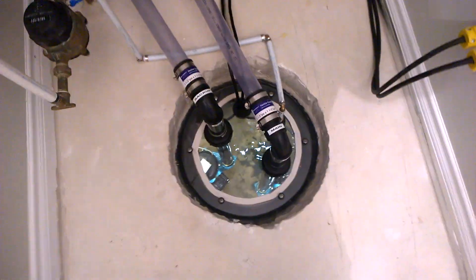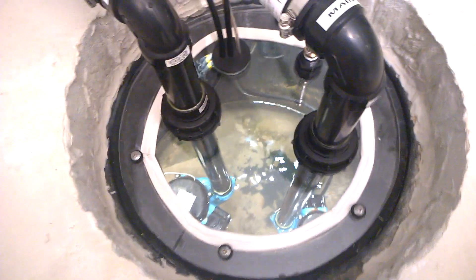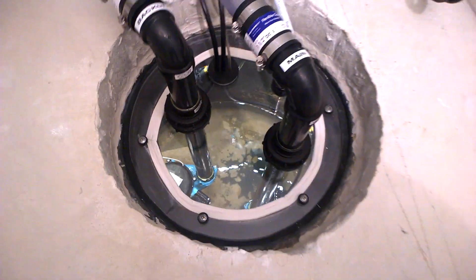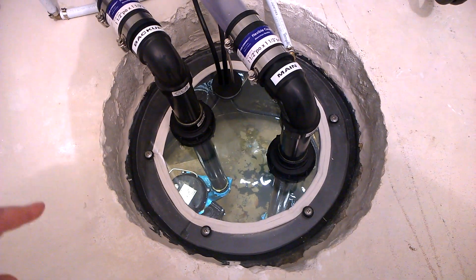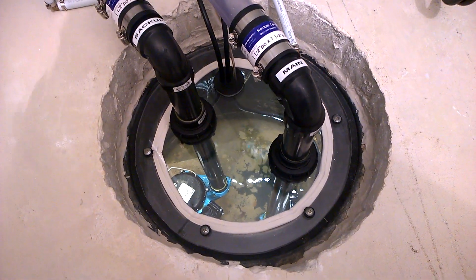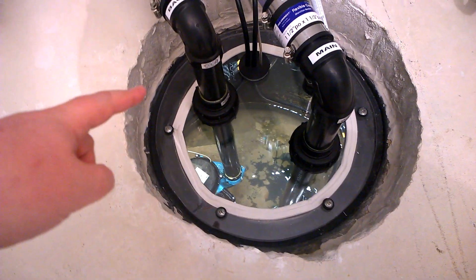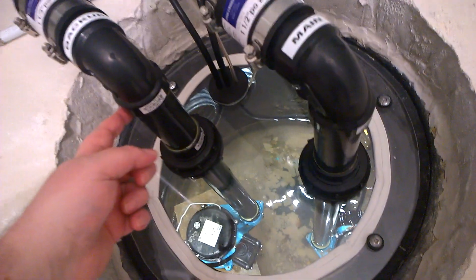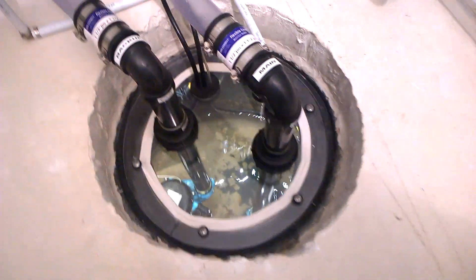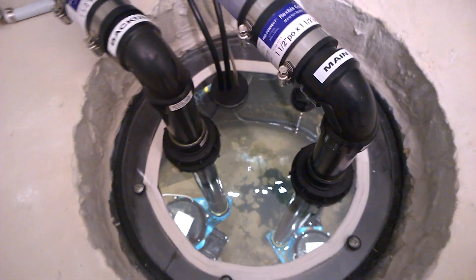As you can see, the pit is lit up. Here in the pit, we've got a clear lid — the lid is half-inch thick acrylic glass. It's been completely sealed for radon protection so no radon can get in. You have threaded bulkheads that go through it for the pipes; it's actually two separate pipes, one section up here and one section in there. Same with the fill valve — that's a bulkhead there, and it's sealed, as well as the electrical cables, which are sealed there too.